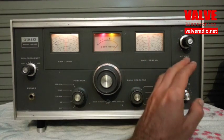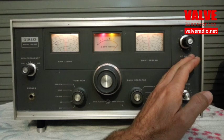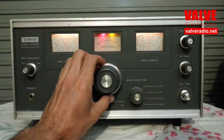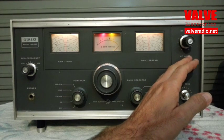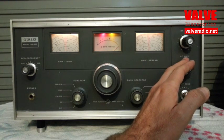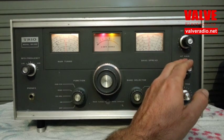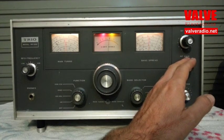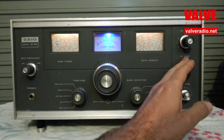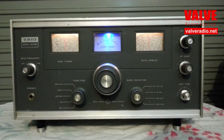The next advantage of the synchronous detector is simply the high sound quality. When we listen to a station and the radio is tuned centrally, the sound is rather muffled, because both sidebands are cut by the intermediate frequency amplifier. If we try to make the sound higher and crispier and detune the radio, we come across high distortion because of suppression of the carrier and uneven sidebands. However, if we switch to synchronous mode, the sound becomes very crispy and clear — really like listening on FM.